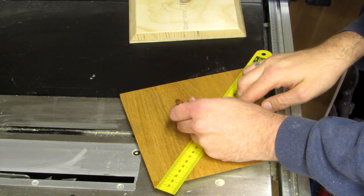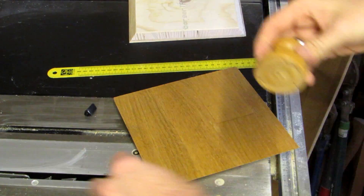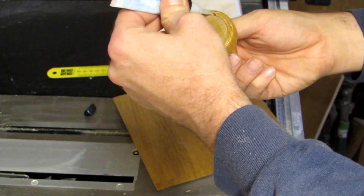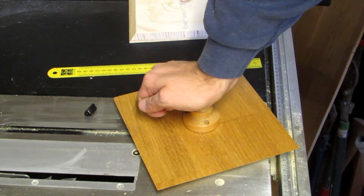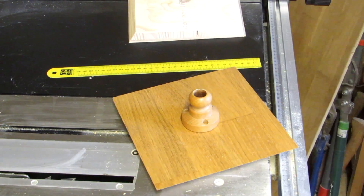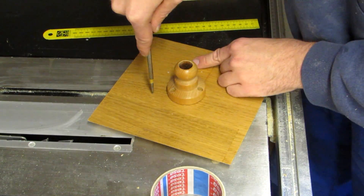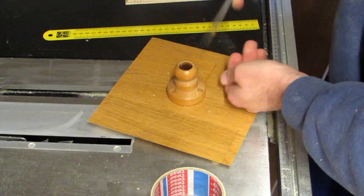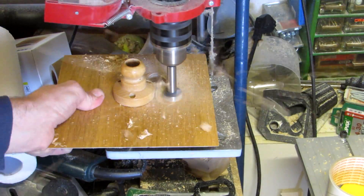In the meantime, I mark the center of what is supposed to be the lid and use another one of the wooden curtain rod holders that I already used for my scrap bin challenge project to make the stem. I'm gluing it in place using CA glue. Then I mark six holes around that to be air holes, and I take them over to the drill press to cut them out using a forstner bit.